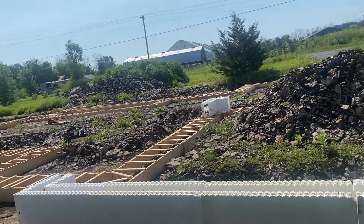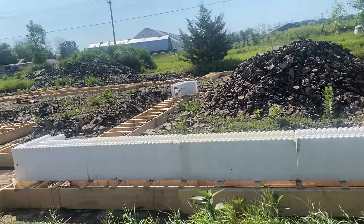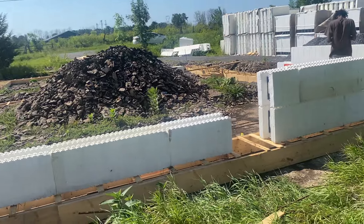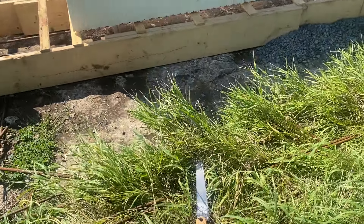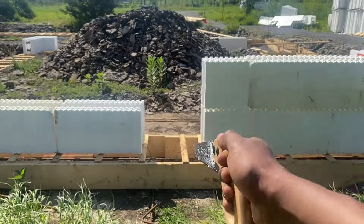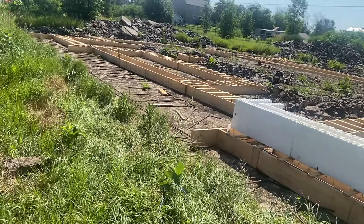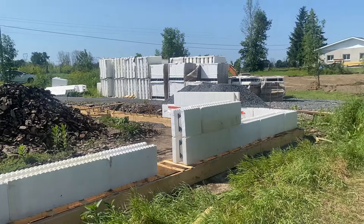Right now nothing is lined up — it's kind of bent. We have to make sure these walls are straight, plumb, and also square. The measurements have to line up, so there's a lot of tedious work that has to happen. Before all that though, we have to put the dowels everywhere — it's over 300 dowels. It should take a day among us. My role now is to show Corey how to do the first few rows of dowels with him, same with the ICF, and then he should be able to carry it out while I'm at work throughout the week.